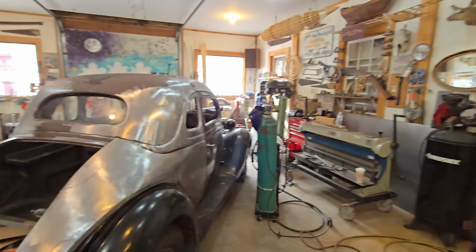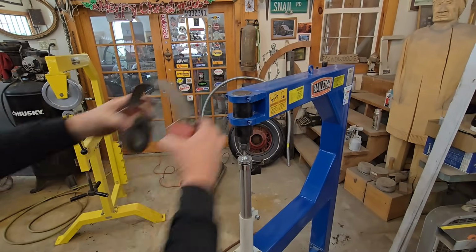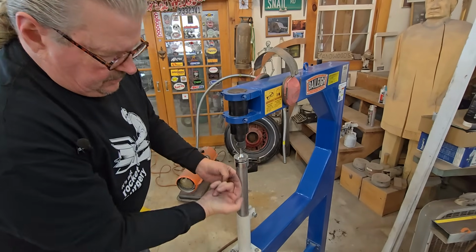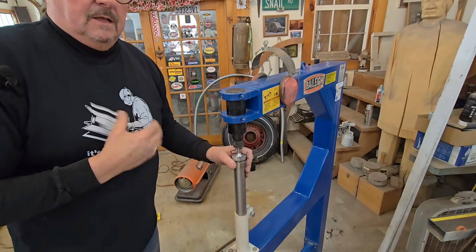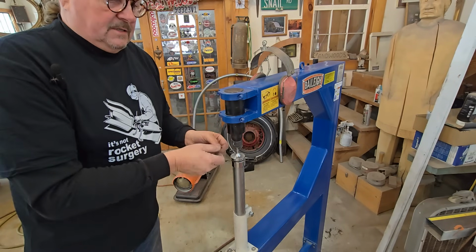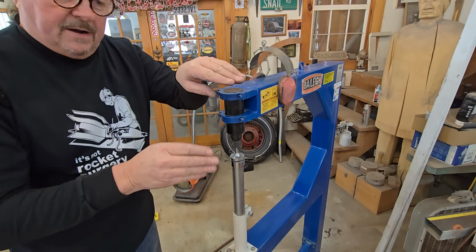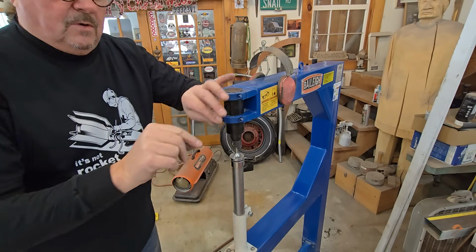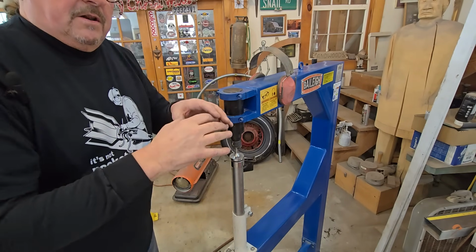Now, another thing I found when I use the hammer here for a second is that when I'm running material through, I can screw this up, and this rises up, put it really tight against here. Because I'm doing finishing work, what I've found personally, because I've already beaten this thing mainly into shape, is that I don't want this hitting too hard, because every time it hits, it's thinning out the metal. And as it thins out the metal gets bigger. So you push it down thin. It's like pushing on dough on your counter. You push the dough down, well, it spreads out. Same with metal. If you're thinning it out, it's spreading it out. So the more you distort that and make that metal thinner, it's distorting the shape.